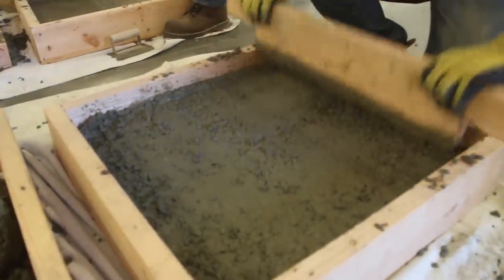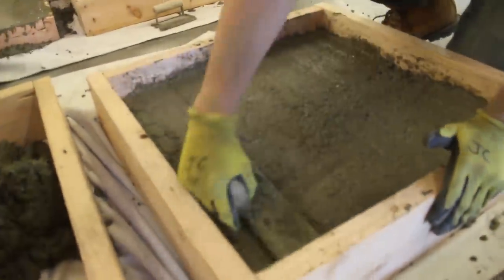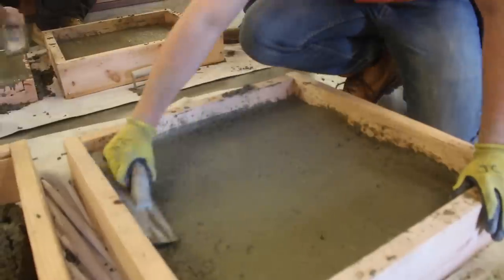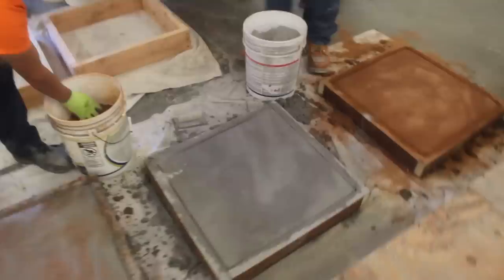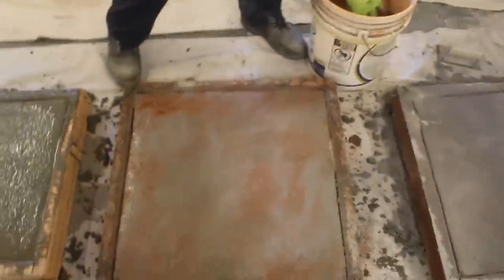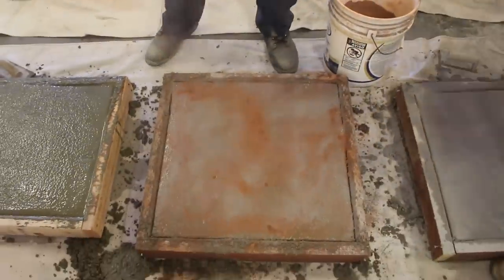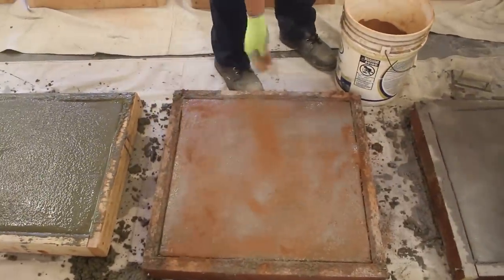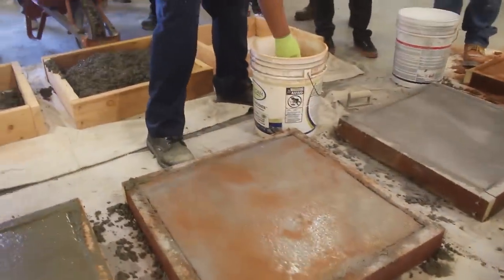What we did here: we had some 2x6s on these 2x2 squares. We didn't really want to make them that thick because they're hard to manage due to the weight. So we notched out a rod board, and you'll find that comes in handy on a lot of different applications. For instance, if you've got a recessed area, set the form to the top, notch a rod board, drop it down, leave your forms in, and build to the top of your tile or brick forms — you still have your straight edge and your screeds. Everything's set one time.